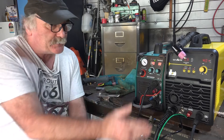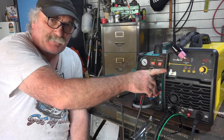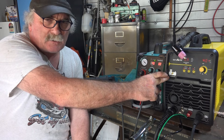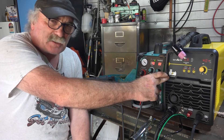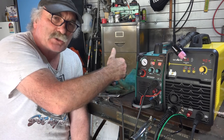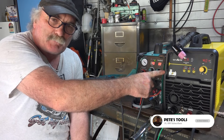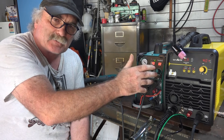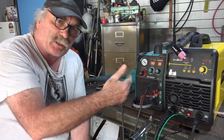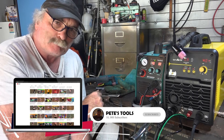So guys, my question at the start of the video was: do these machines use less air than these machines? Well, according to my experiment — absolutely not. And I wouldn't have thought this thing could cut 10mm, but I'm pretty convinced it can. The duty cycle on this machine is about 60%, meaning you can use it for six minutes out of ten then let it cool down. The duty cycle on the other one is about the same — 60%. This one here you need to plug a big compressor into, which is ideal if you're working at home in your workshop. But the one with the built-in compressor is excellent if you're working outside and don't want to cart a big heavy three or four horsepower compressor around. Anyway guys, hope that answers some questions. Remember to subscribe, like, drop me a comment — come say g'day to the old git, and we'll see you next time. Happy plasma cutting!